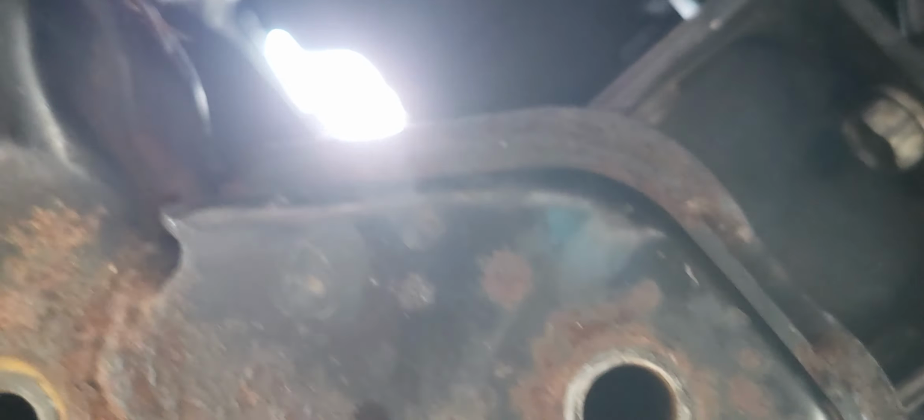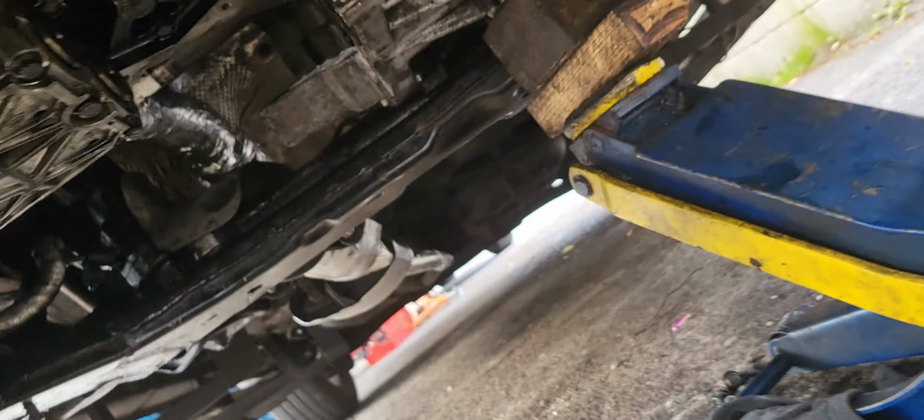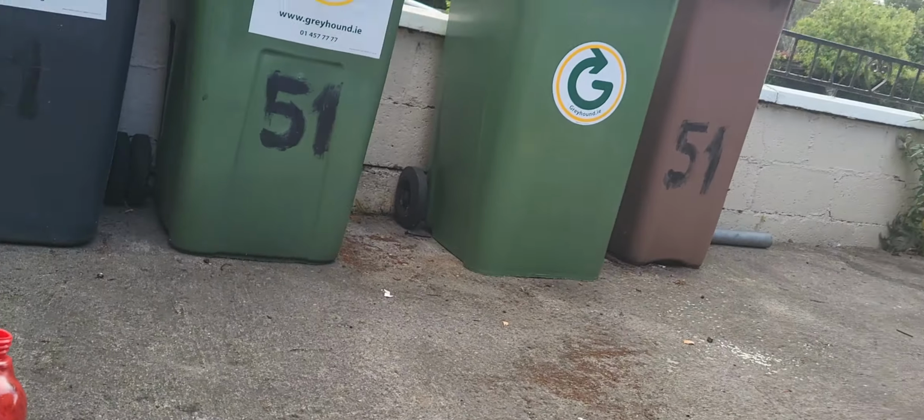And then the reason why the hydraulic jack is in here is that we have to remove the 16 bolts here. This is the front engine mount, and the rear engine mount also has 6 bolts to remove. And then one bolt in here, 16 at the center, that's over there, has to be removed in order to lift it up a little bit and make enough room to get the oil sump, or the oil pan, down.